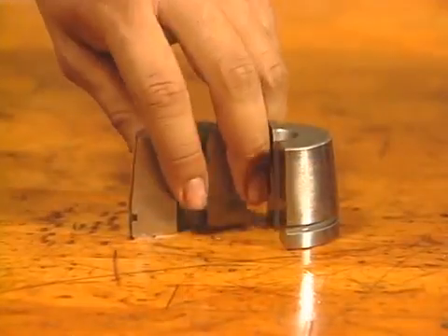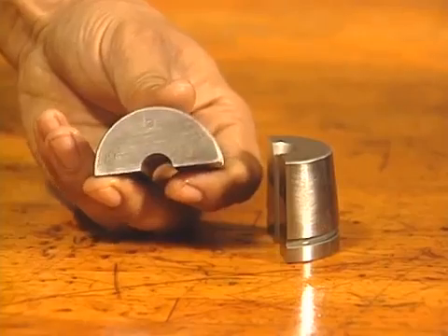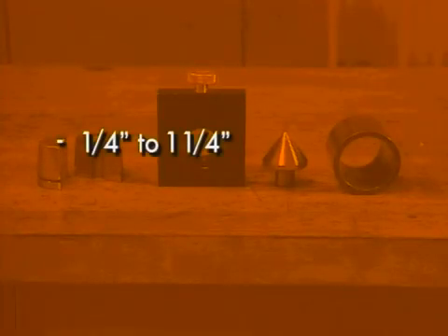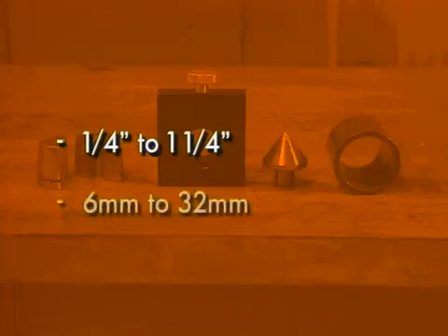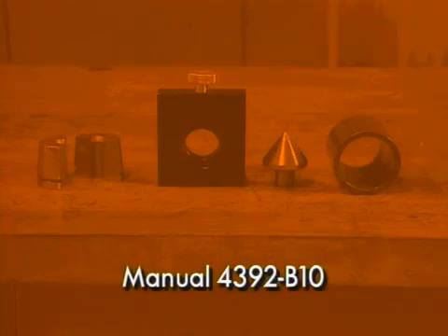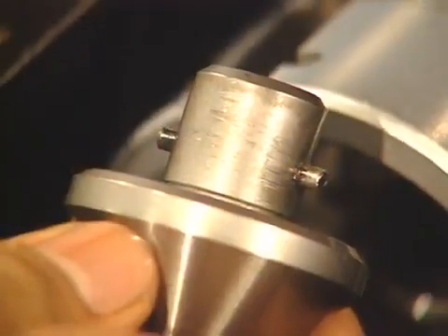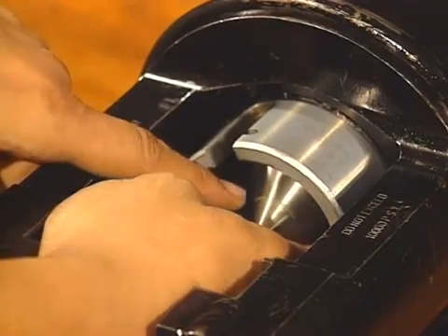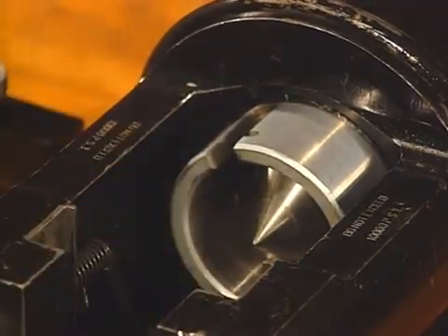Your dies are stamped to match specific outside tube diameters. Check the size marked to know which is appropriate for the tube. For tube diameters that are a quarter inch to one and a quarter inch or 6 to 32 millimeters, you choose these specific parts. For larger tube diameters, you select these. You can also refer to manual 4392-B10 for more selection information. Once you've chosen the correct parts, start by inserting the flaring cone into the piston. Turn it until the roll pin engages and locks the cone into position.